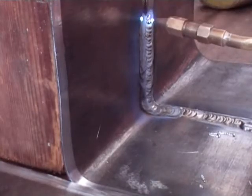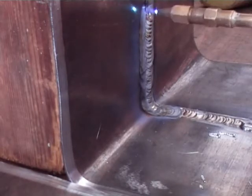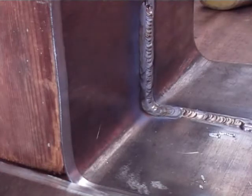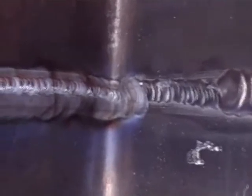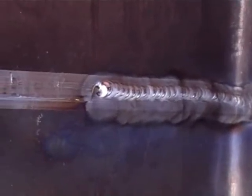Same technique. And you see the flame again — nice round tight balls. You have to be one or two millimetres above the molten metal. If you lift off you can have all sorts of problems: the weld spreads out, it is going to undercut here, there and everywhere and it is going to look horrible. Here again you can see the staining on the lead from the flame, nice light grey colour. After cleaning it up you can see the weld a bit better — it is quite acceptable, and you could get that absolutely perfect with practice once you have learnt the technique.